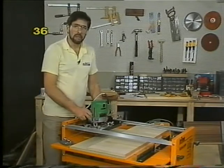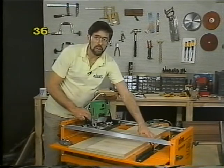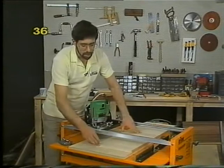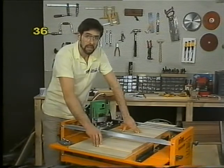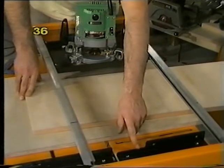When using the router in this mode, you'll almost certainly find the table is too low for the router cutter to reach. Don't raise the table — rather put some packing under the piece you're going to be routing. The packing does two things: it offers the workpiece up to the router cutter, and it'll prevent you from cutting through the notched workstop. This cutout in the workstop allows the router cutter to pass through, so you need packing which at least gets you to this point.